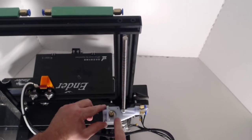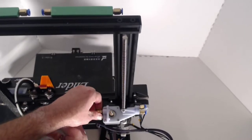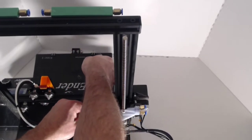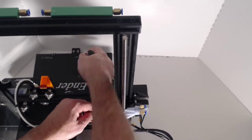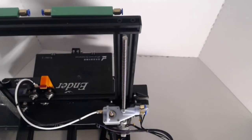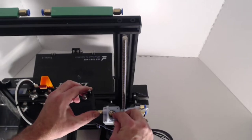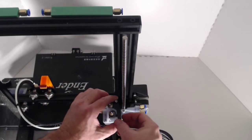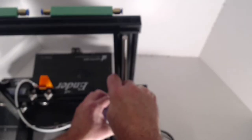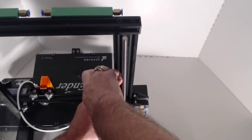The screws are mounted — nice and rigid. Take the PTFE tube and screw it back into place. That's installed. Now it's time to reinstall the extruder arm: place the spring in position, place the arm over it, and use the 2.5mm screw to find the hole and screw it into place.